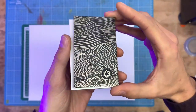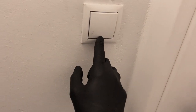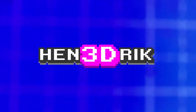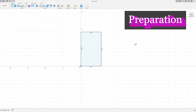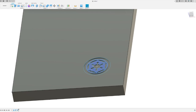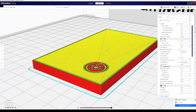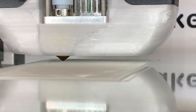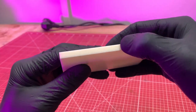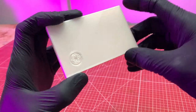Sit back — it's going to be a little bit complicated but have fun, just have fun. First you need a 3D print of course. Make sure that you do not model the pattern, it will be plated later. Then print the whole thing. To metal plate it shiny, the object must be very smooth, so I will now work on it with filler spray and sandpaper.